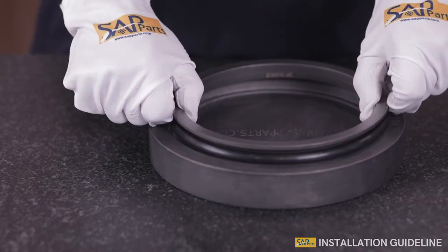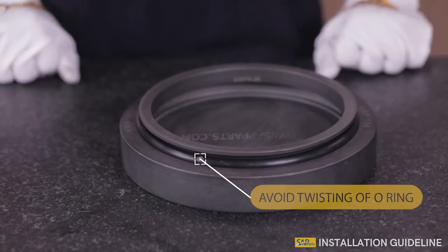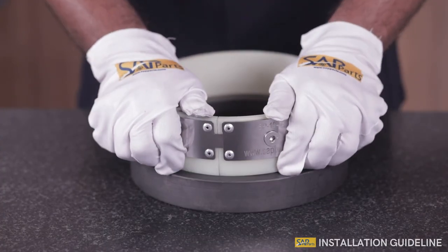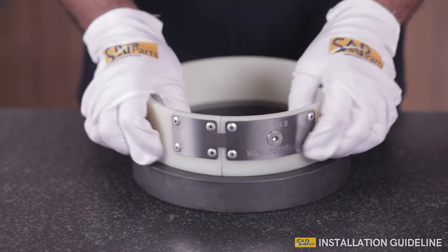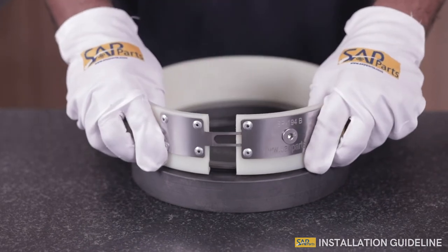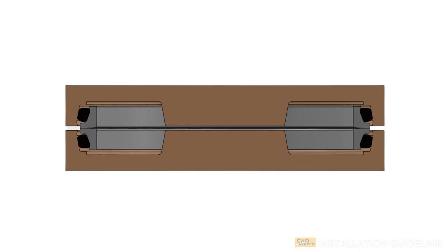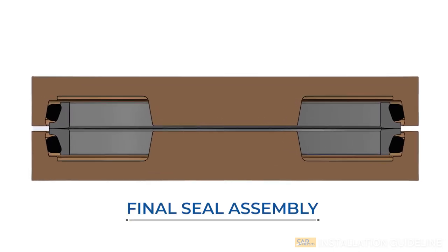Step 3: Hold the seal and O-ring firmly without the O-ring being twisted. Locate the seal and tool on the groove opening. Step 4: Press the fixture on the O-ring and notice the O-ring insertion jerk inside the housing. One can manually fix the small rings and apply gentle and even pressure for big rings around the rim of the guide plate. Step 5: Once all above steps are performed in a systematic manner, the final seal assembly will appear like this.